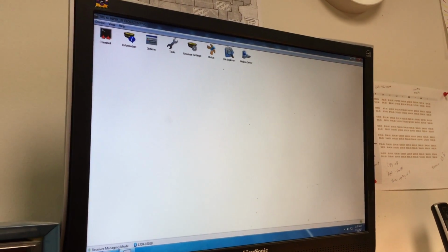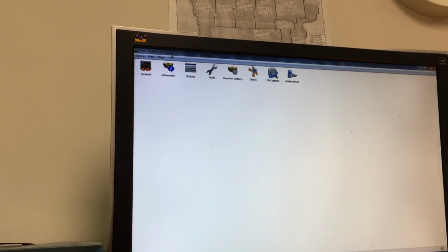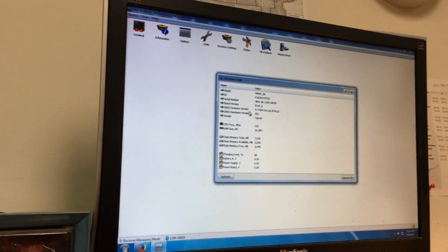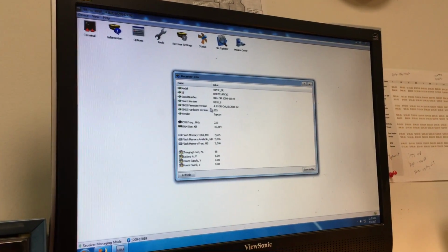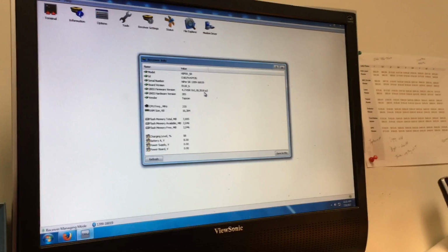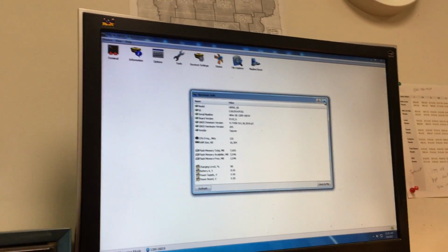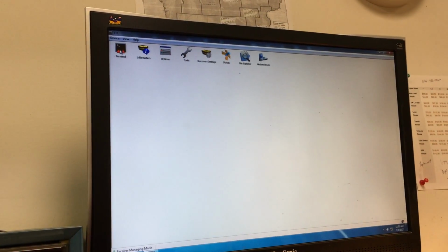Once it makes the connection, you'll look down here to the bottom right, this will go solid green, and then you'll see your Hyper, in this case SR, ID number here at the top. To check my current firmware, if I click the information bar, I can see that my current GNSS firmware with this particular unit is 4.7P2, October 18, 2016. Under the current updates, we need to have 4.7P4 for this unit to be active. So in this case, I do need an update. So I'll go ahead and close from here, go back to my device, disconnect.